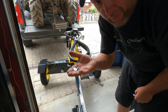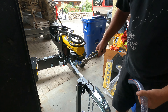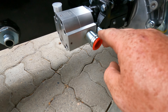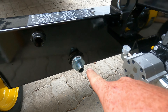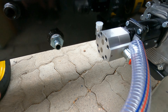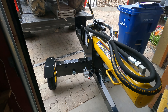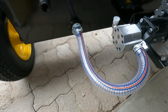Next is hydraulic hoses. This one goes down from the actual pump to the reservoir, which is where the axle area is. Just remember to remove these red plugs — they said there may be residue of oil in there. This hose goes from the pump to the reservoir. It's pretty much just hooking up all these hydraulic hoses now, and then the guards go on last. That one's all hooked up — fairly simple. There hasn't been anything too challenging on this build actually.